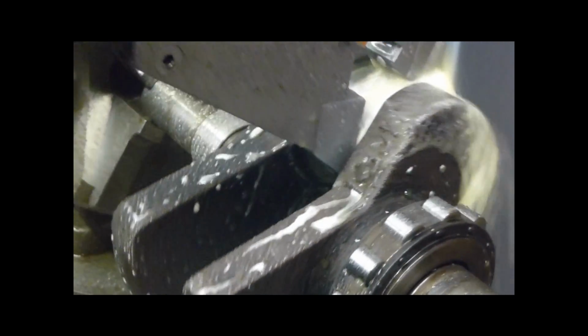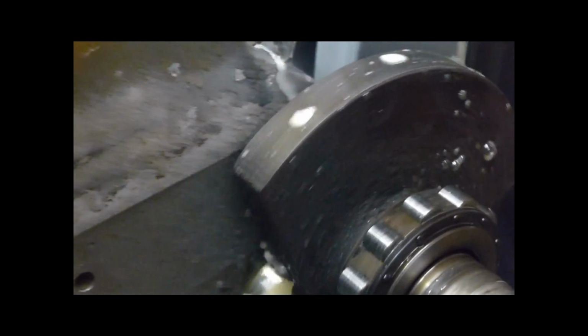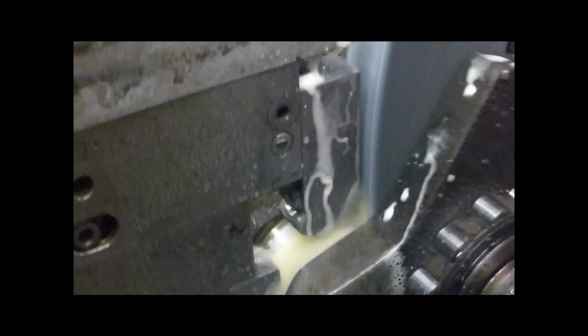That's down to zero now, and there's another 4.5 thou come off. See, that's back to zero where I was on this side. So that's got the same size now. So now there's 4.5 thou to come off. Right. Isn't it? No, 5.5 thou to come off. Anyway, I'm gradually feeding in, look. As it's going round, that's grinding. 2.